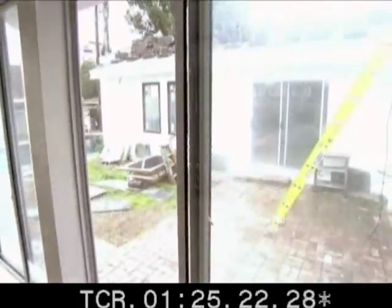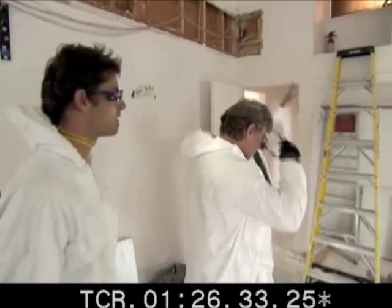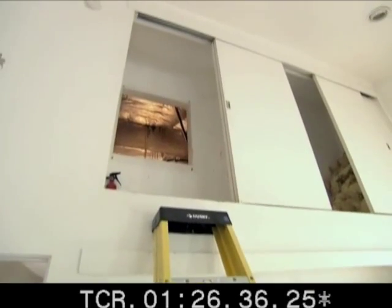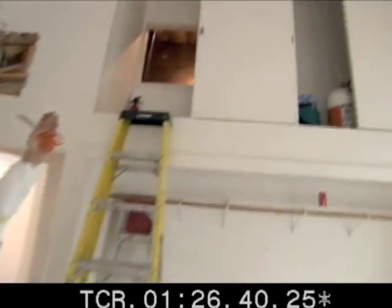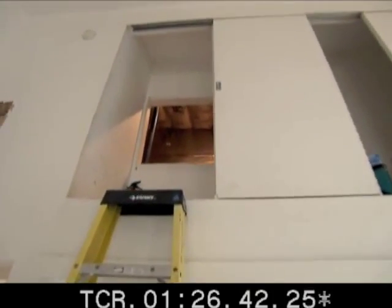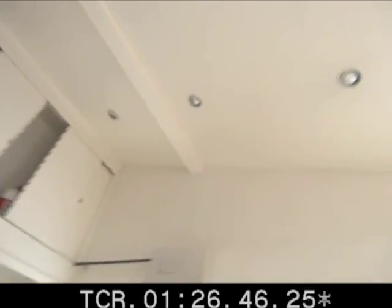And that's not the only eco-friendly feature going into this kitchen. The task at hand is to insulate this little attic area. The attic will house what we call an air handler. It'll work with their water heater and air conditioner to efficiently heat and cool their house. The trouble is, this space can reach up to 140 degrees in the summer. We don't want this unit fighting that heat to produce cool air.